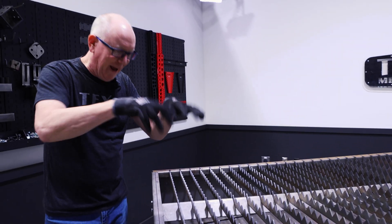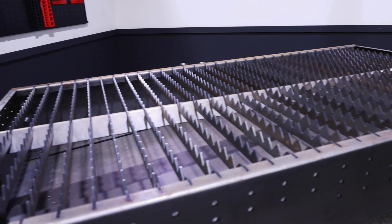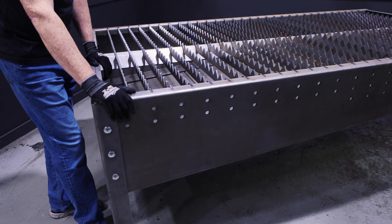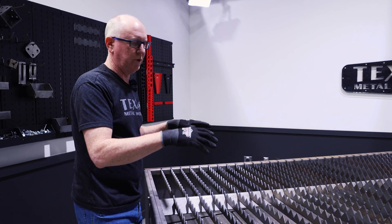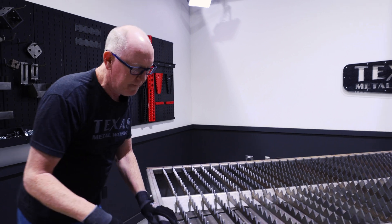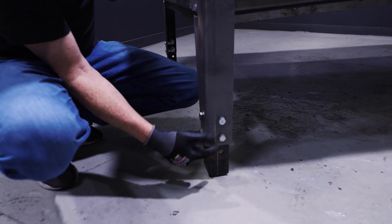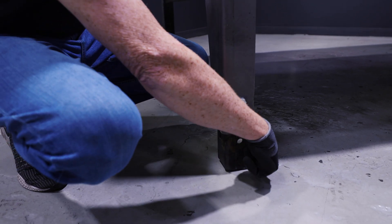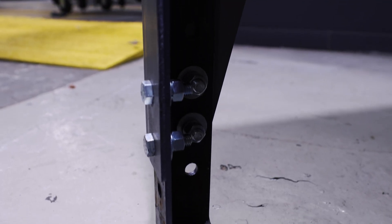This table is made out of completely folded, bent steel plate. The side walls are three-sixteenths inch, and the entire length is bent with one, two, and a third bend down here, making it extremely rigid. It's also pretty heavy, so it doesn't move if you're applying a CNC to it. The legs are adjustable height with bolts on both sides and extra holes to raise it. On the inside there's a hole for mounting it directly to concrete, so this table can be fully bolted down.